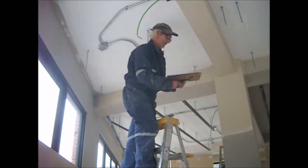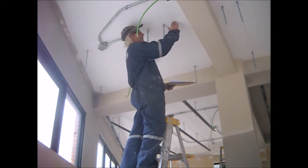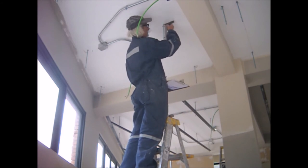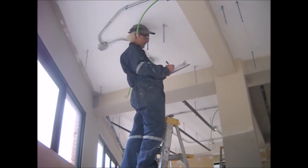To establish if the rods are perfectly vertical without using a laser level, we must consider two planes. Let's suppose this is one plane. This is the X and this is the Y. This is one plane, and over here we have Z and Y. This is the ZY plane and this is the XY plane. In this case, we have a near perfect angle. Very little deviation from the vertical. In this bearing, we have a small deviation, not more than 5 millimeters, nearly perfect. So, for this thread, we'll enter XY is excellent and ZY is excellent, nearly perfect.